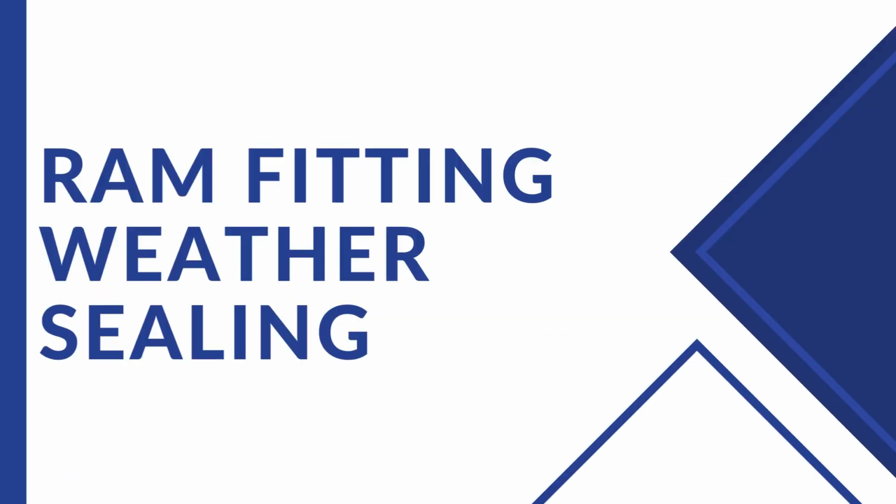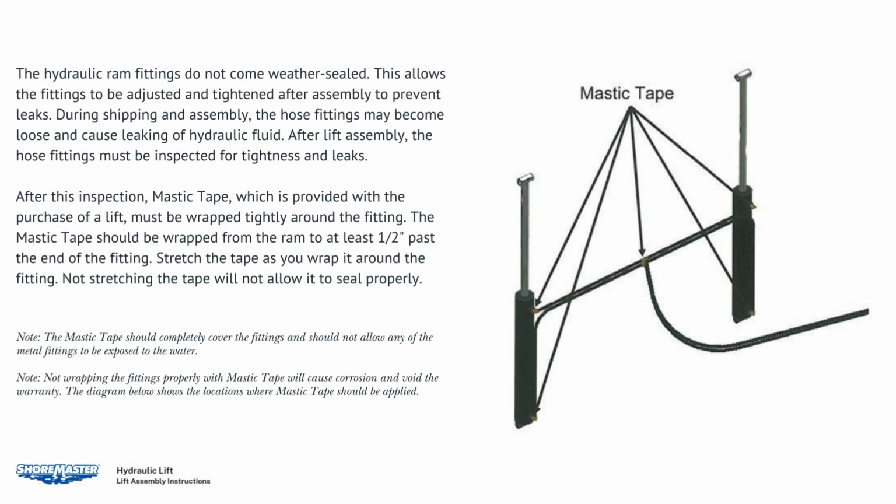Ram fitting weather sealing. The hydraulic ram fittings do not come weather sealed. This is to allow the fittings to be adjusted and tightened after assembly to prevent leaks. During shipping and assembly, the hose fittings may become loose, causing leaking of hydraulic fluid. After assembly of the lift, the hose fittings must be inspected for tightness and leaks. Refer to the previous hydraulic system test.